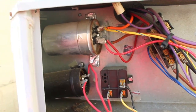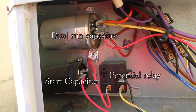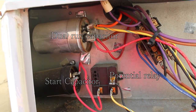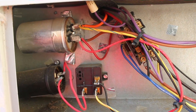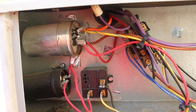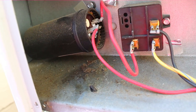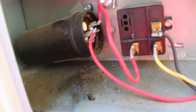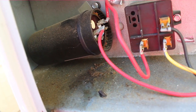As you can see guys, there is a relatively new capacitor — I think I put that one in a few years ago — and a 521 hard start, which I replaced when the original start kit became damaged. We're going to take this capacitor off and see if it's any good. I did find some oil down here — not refrigerant oil, but capacitor oil like castor oil. I'm not sure if that was from before or this time, but let's double check.